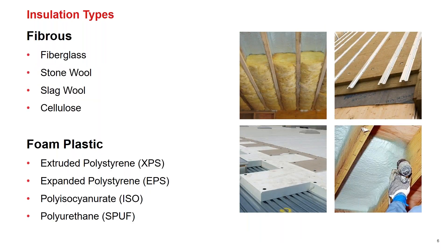One of the easiest ways to reduce energy usage of a new, remodeled, or refurbished building is to add additional insulation. Increasing the efficiency of the building enclosure means the building requires less energy to maintain the same interior conditions. The majority of insulation types in the marketplace split into two categories: fibrous insulations — fiberglass, stone wool, slag wool, and cellulose — and foams and plastics, which include XPS (blue board or pink board), EPS (basically styrofoam, like a coffee cup), polyiso, and closed cell or open cell spray foam.